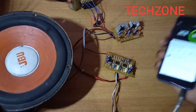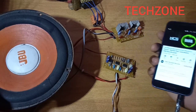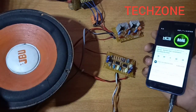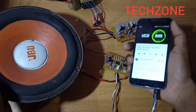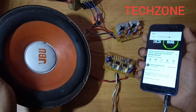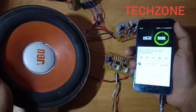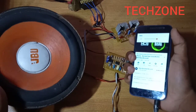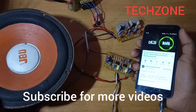Friends, I want to consider the usefulness of this situation. I will call it a home theater setup. This is for the subwoofer. You will be able to use the sub replaced by the TDA2030 IC with the TDA2050. You can replace the IC and try it. This is a 5.1 board — TDA2030 and STK IC combination with the 5.1 board, in the center channel and the FL/FR channel, using the TDA2050. Now, this video is very useful. See you in the next video. Bye!